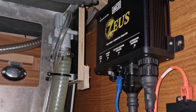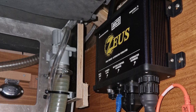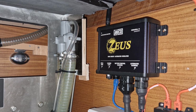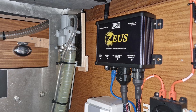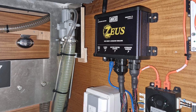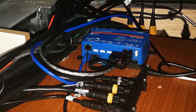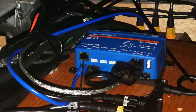Moving upwards, we'll see the Arco Zeus remote regulator — it's a great system. Pay attention to that blue cable at the bottom of the Zeus; we'll talk about that in a moment. This is an amazing bit of gear, fairly new to the market. It has two wiring looms: one goes to the alternator and carries things like the field current wire, the other goes to the battery system. That blue cable is an ethernet cable which goes across to the Victron Cerbo GX system controller.